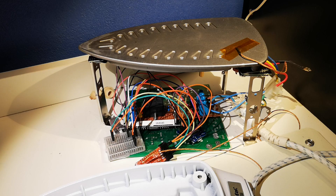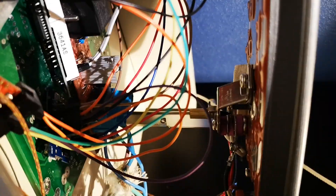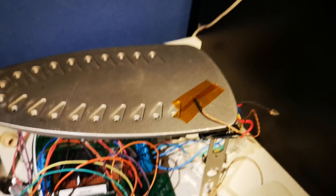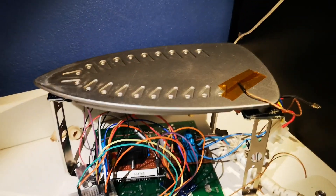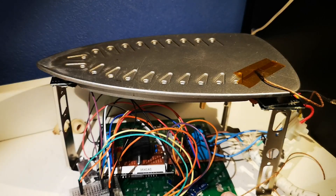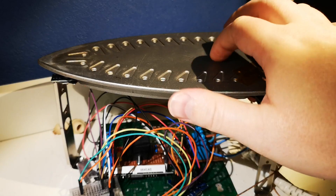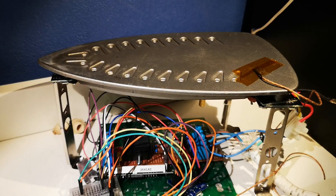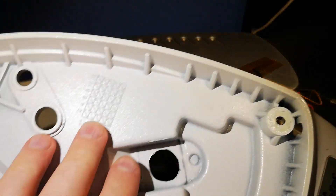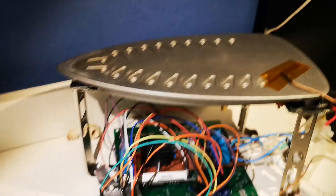The thing was that this element underneath here — since the meshing is on top it will take a very long time before the top gets hot. So what happens in the PID controller is that the element gets a lot hotter than what is measured up here, to compensate and get it up to speed. So I think maybe this cover got really hot. Got rid of that — it looks actually a bit sleeker now.